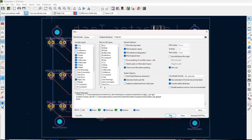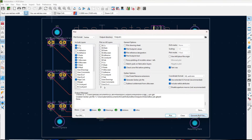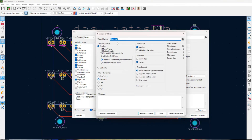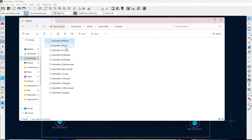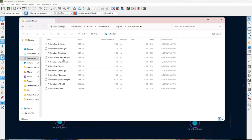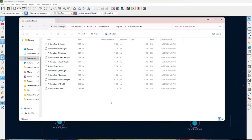Also from this window, hit Generate Drill Files as well and get those drill files. There are other things you can generate here, but Gerbers and drills are the only things I've needed in my experience. Then go into that directory, compress and zip all the drill and Gerber files together in one location. I never include that Gerber job file and no one's ever needed it before. Now with that whole packet zipped, you're ready to upload it to a PCB hobby board manufacturer.